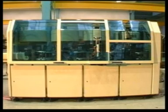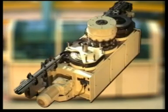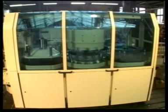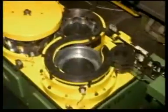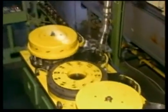The Gamma is a modular system consisting of a main drive unit and individual modules connected to each other depending on the job to be performed. The modules shown here in this example are the cutting module, the flanging module and the beading module. This approach allows a range of different technologies to be combined. Such technologies include parting, flanging, beading and seaming.